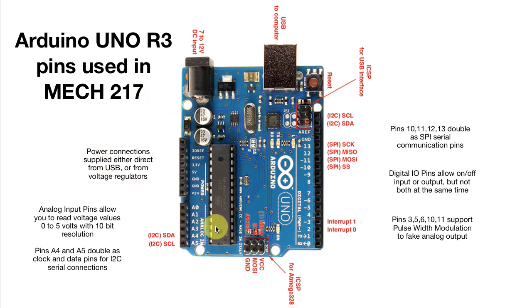So first off, it's a standalone microcontroller. Once the processor is programmed, you can start it running just by applying power. And that power can either come from a USB connector connected to a computer, or a battery, or a USB charger that you might use for your phone, or from an AC adapter, one of those wall warts you might plug into the wall, with a voltage of 7 to 12 volts, which will be reduced down to 5 volts